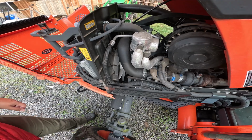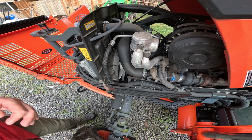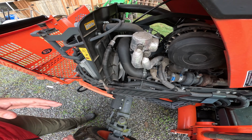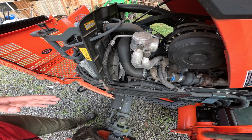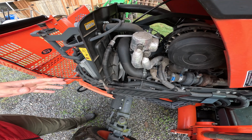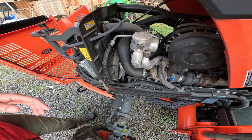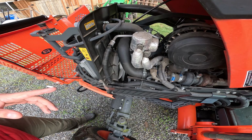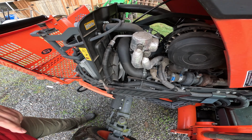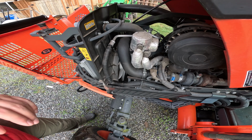The manual says to loosen the bolts on the alternator, apply a lever against the block and pull it out until there is no more than 7 to 9 millimeters of deflection in the belt. Right now it seems like about a couple inches, which, I mean, centimeters to inches. It's a lot more than it should be. But look at the mess you have to get through to make that happen. I'm looking down in here. There is a manual tensioner on the air conditioner belt that looks like a screw tensioner. Awesome. It's just on this side, so you can actually get to it when you have the alternator cover off. So we'll get that done.